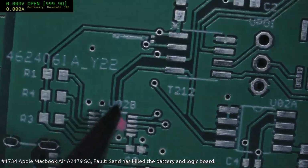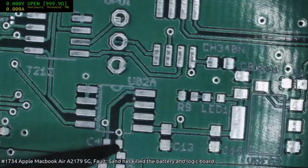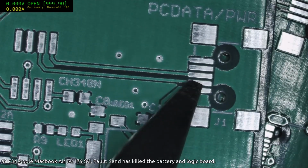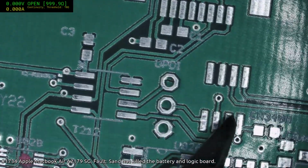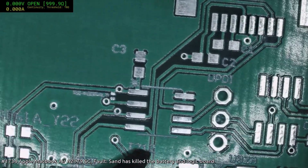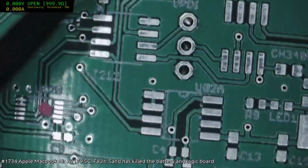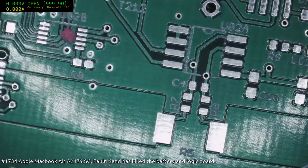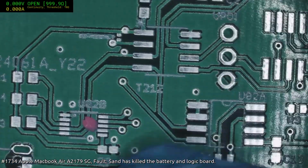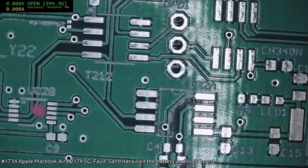I do keep the boards, because if you ignore that part of it, then you've still got a board that can be useful for a number of things, because you've got a regulator, you've got a USB-C, USB mini interface via serial, and you can put a controller or anything like 212, 812, whatever, and then you've got access to I2C lines. So it's a useful board for future prototyping. So that's why I don't generally throw a lot of my boards out, but I do mark them to let me know that, hey, don't use this for an actual production.